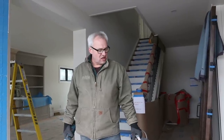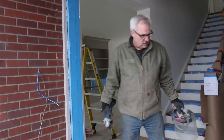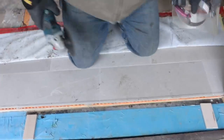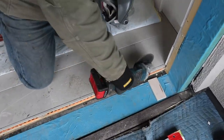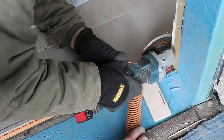Installation here in Southwest Calgary. We had come in and I had completely prepared the rough opening, previously had done all the blue skin and everything here, and we've shown up and, kind of typical, sometimes things don't go the way you want. As much as I tried to make my job easy today, the tile guy has gone 1/2 to 5/8 inside the drywall, so we have to hand cut this out with the wheel grinder now, just to add to the fun of our day. So we'll keep you posted.